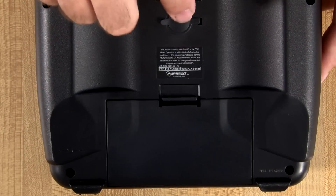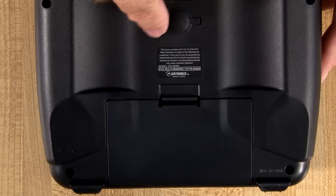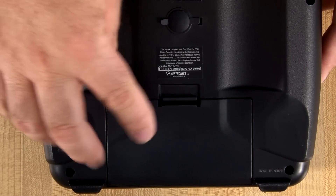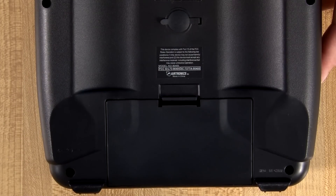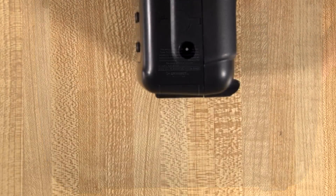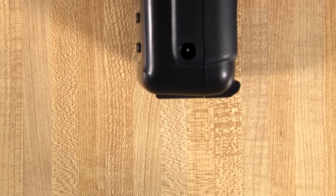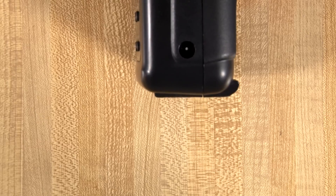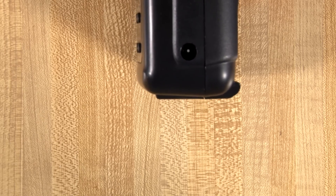The SD5G trainer cord is put right in here and there's a little cover so that it's protected from dirt when you're not using the trainer function. Right below it is the battery box, and the battery box uses six AA batteries. This radio can be run with rechargeables or with regular alkalines. So if you forget to charge your batteries or don't have a charger, you can throw alkalines in and the radio will be up and ready to go. If you do decide to put in rechargeable batteries — either nickel metal hydride or NiCAD — we do offer a charger and the charge jack is right here on the side of the radio. So it is set up for rechargeable batteries even though it doesn't come with them.